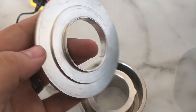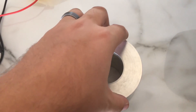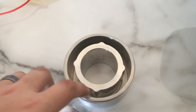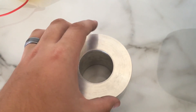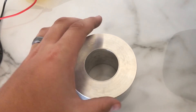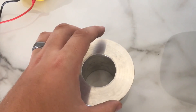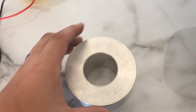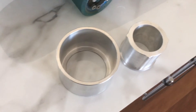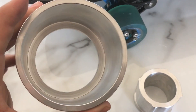That extra lip for the surface of the motor basically slots in like that. We put the urethane in up to the top and then place the cap on to get the shape we want. It's going to be touched up with CNC at the end to get rid of excess urethane. The extra part of the mold looks like this — basically a ring with a lip for the outside to house the insert.